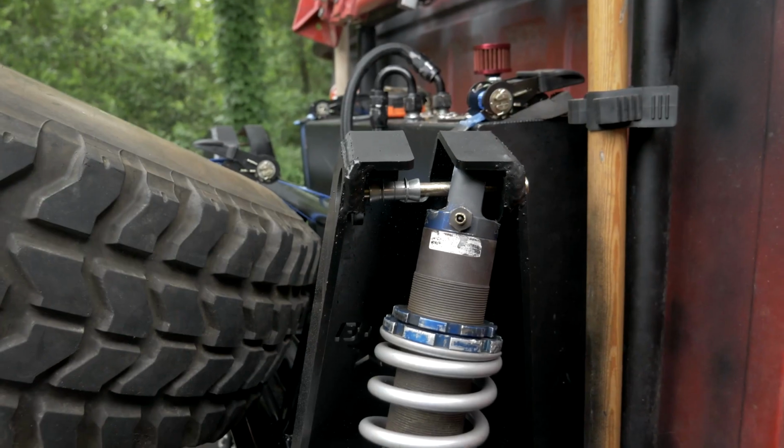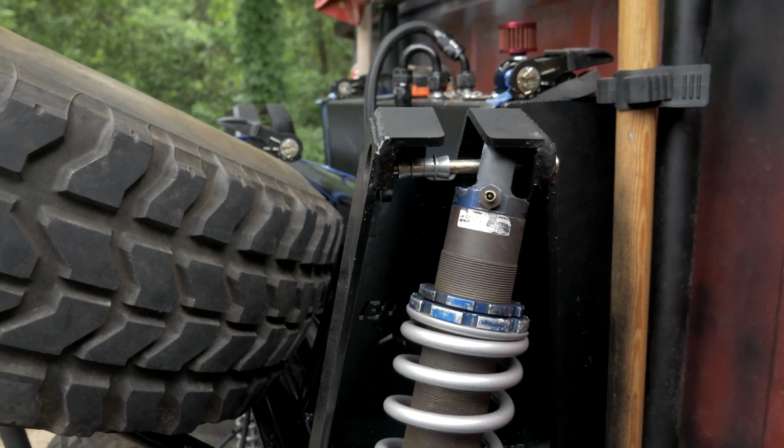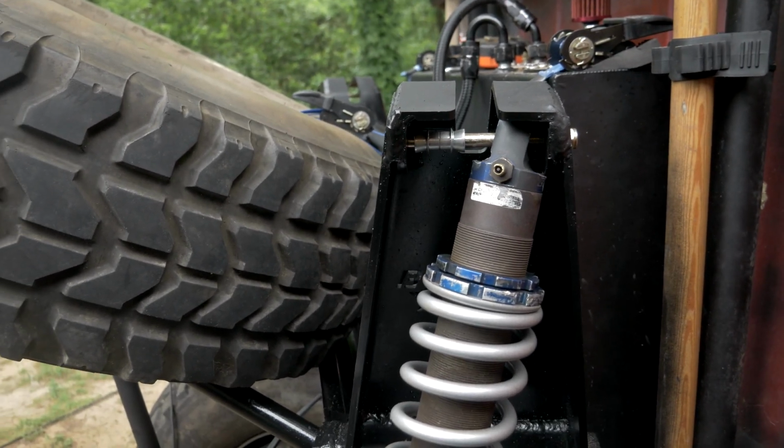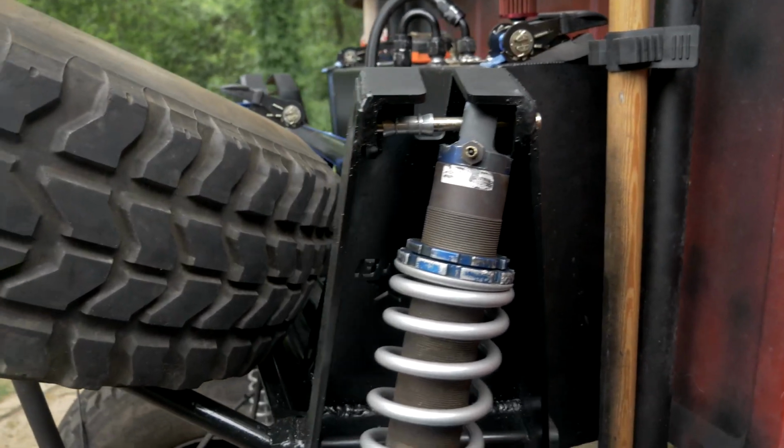As you can see, I don't have the misalignment spacers in because I'm waiting on some more bolt spacers, but that's how those are gonna work. 2 misalignment spacers going through the top of the coilover, and then some spacers going to the edge of the bolt, and some grade 8 washers.